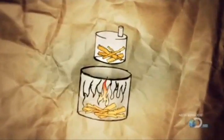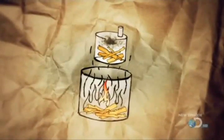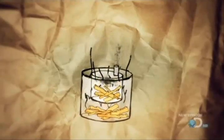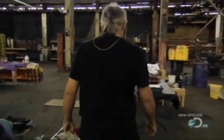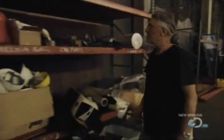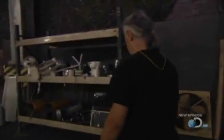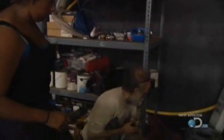The gasifier's fuel container needs to reach 451 degrees to start producing wood gas. One way to increase the temperature would be to place the wood container directly inside the drum. Vladimir's modified design requires a smaller container for the wood and a longer pipe to release the wood gas. Vladimir looks for a pipe, while John finds an Army surplus gas can.